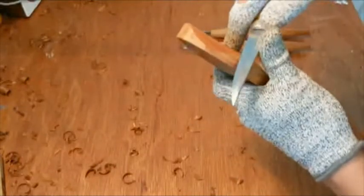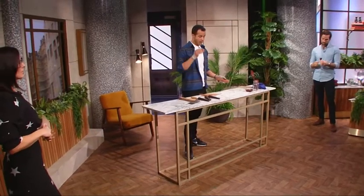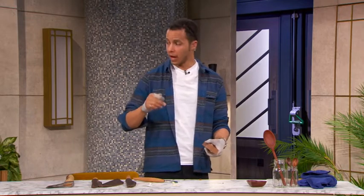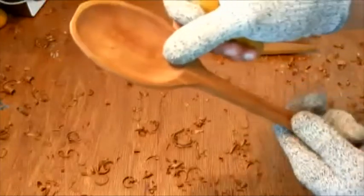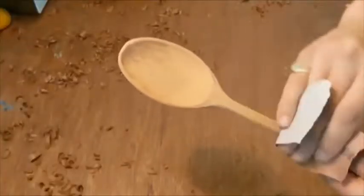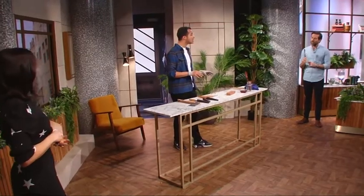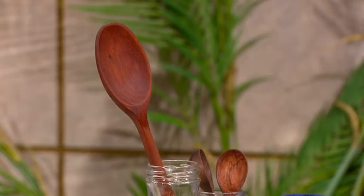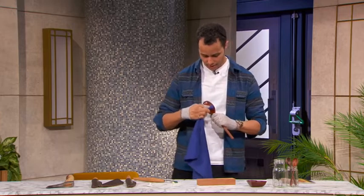Is there a technique or are you just doing this freehand? You kind of freehand it, trying to mirror the same shape as the inside of the spoon. Once you've done that, you shape up the handle — chipping away, smoothing it off, really doing things by eye, finishing off with some sandpaper to smooth out those rough edges. Then finally, once that's all sanded completely smooth, you can use some food safe oil to seal the wood, so you can use it for cooking, and it brings up the lovely grain of the wood and makes it look really nice and shiny.